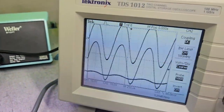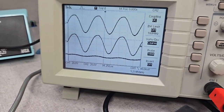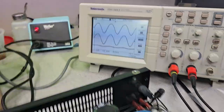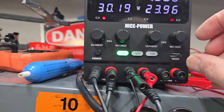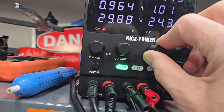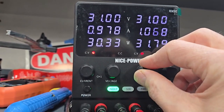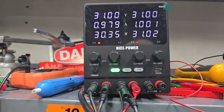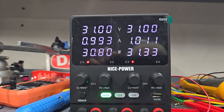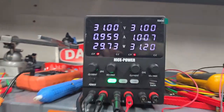We're actually looking very good here — looks like we're just on the edge. I'm on 9, this thing is running pretty well. The voltage is dropping — hit the current limit here, see. Okay, there we go — now we're back to just a little more than an amp. I needed one amp per side: 31 volts and 60 watts.